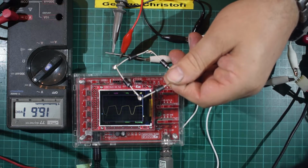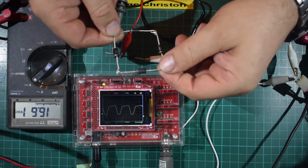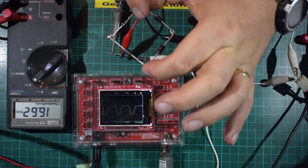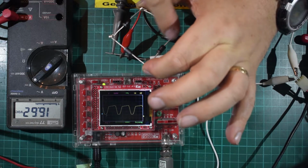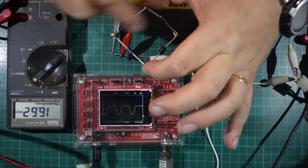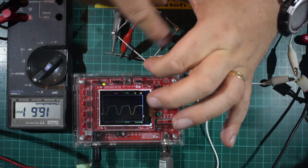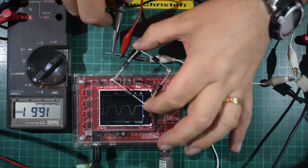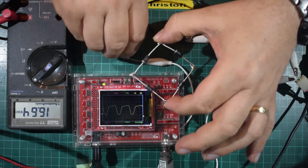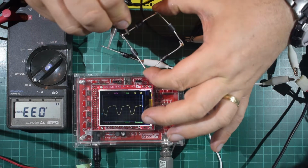we have to then figure out which way they connect. Now, always the AC goes in the middle of the bridge, and you can tell the middle because the 2 diodes on that side and the 2 diodes on that side point the same way, so everything's pointing forwards. And that then means that we can connect the plus to the end, if I can get that in there,